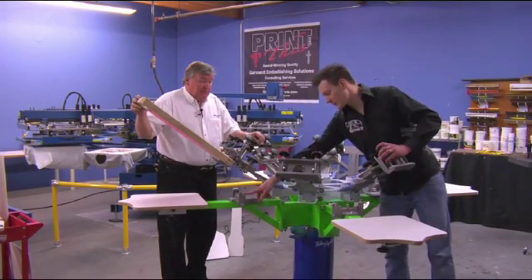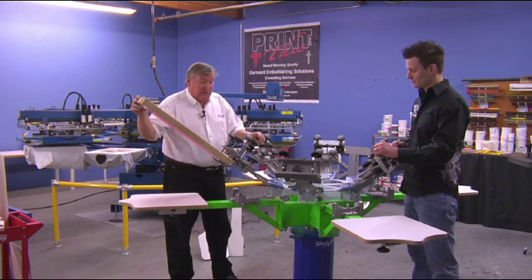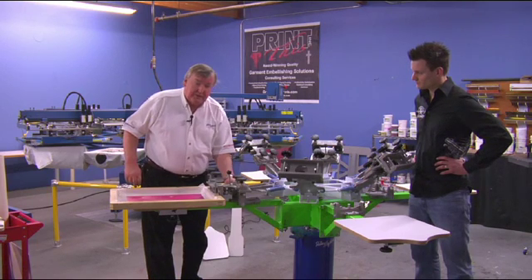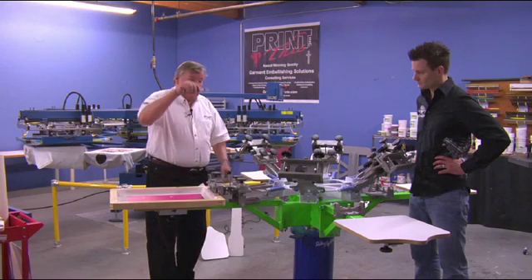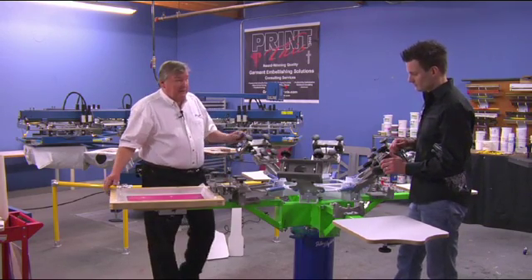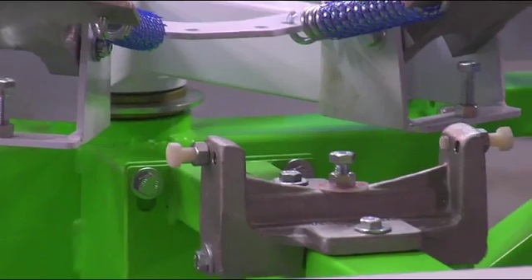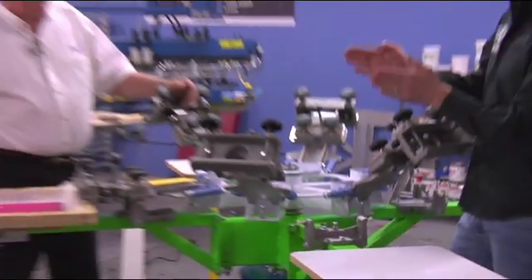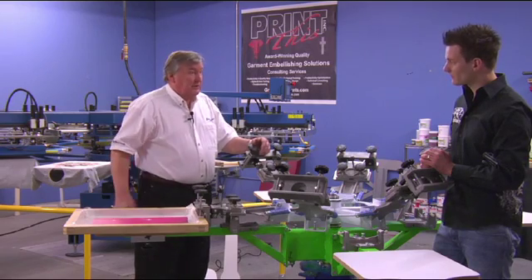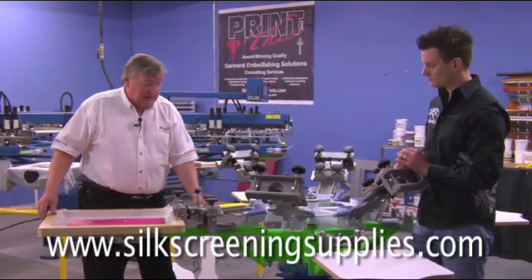How much does this part cost to replace and how often does it need to be replaced? That's a bone-crushing $3 a piece, and there's a good five years' worth of wear on these things. When you set this clearance, you don't need to put it in tight — finger tighten it and then just go about a quarter of a turn on the jam nut, because this is nylon. If you treat it like a regular bolt, you'll snap the head off. This is the jam nut right here — you want to tighten that down so the bolt doesn't move out, just a little bit. As the bolt wears down, you'll start to feel a little bit of give. Check the press in the morning to make sure it's copacetic; if it's got a little play, just tighten it up.